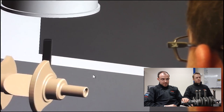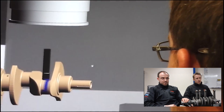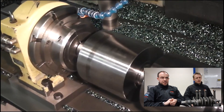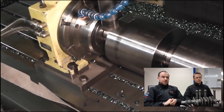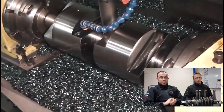So moving on to the cranks now. This is part of the CAD work and the design work - they're just making sure that the program will allow the machines to do what they need to do. And that's presumably how the billet crank starts out - a massive lump, a big round bar of steel, which is then milled through various operations as you'll see in the next few stages.